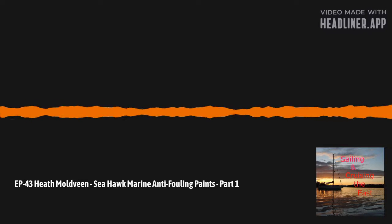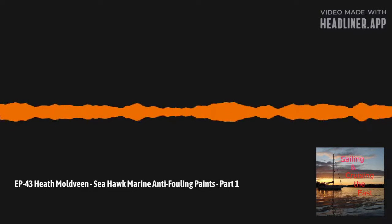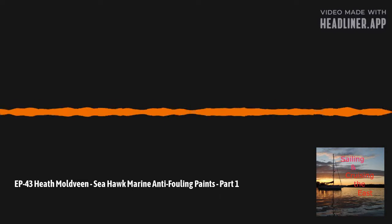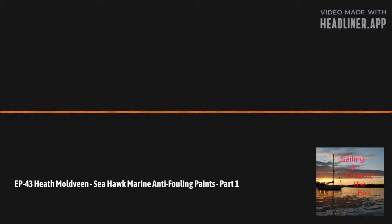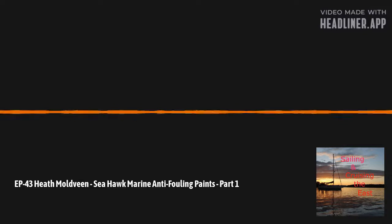For example, with ablative paints, if you think about it, they wear away. If you put that ablative paint on too thin, you're not going to get the performance that you want for the whole season or 2 seasons. So it's imperative to make sure, A, we're using the right tools, we're prepping right. Prep is huge. That's your foundation. And so you go through all those steps to make sure that the yard's doing it as we would recommend them to do it. Now, we're not drill sergeants, but we're there to help them and work them through it.